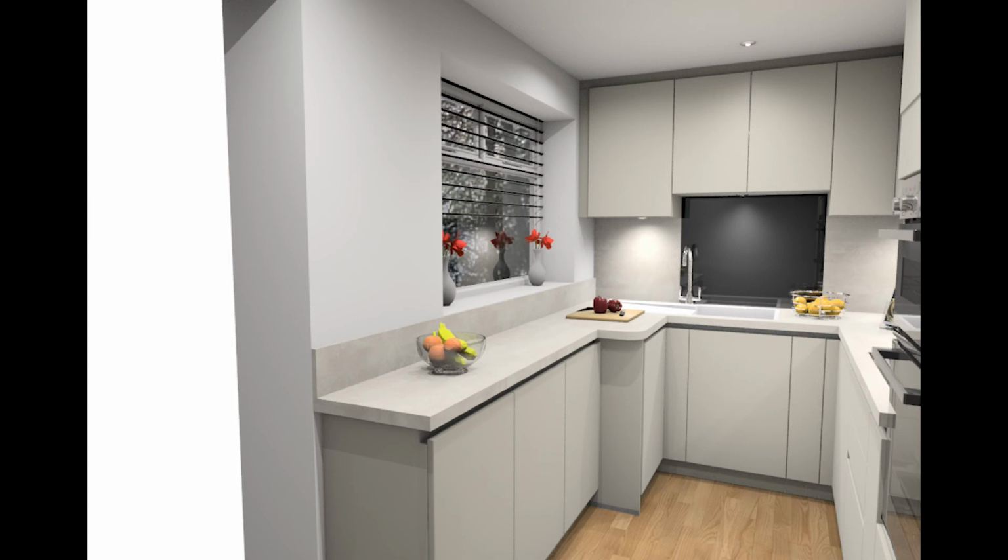One thing to note again, if you're using somebody who can do specialist worktops for you, that worktop that's rounded there and comes from deep to shallow can actually be made in one piece with no joint. So again, it's always worthwhile considering trying to go for better quality, even if they're laminate worktops, and they can be made in one piece without joints.